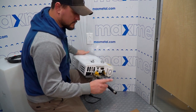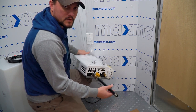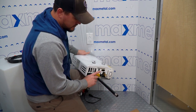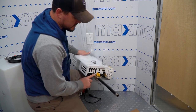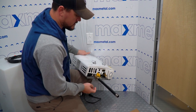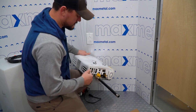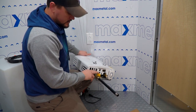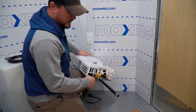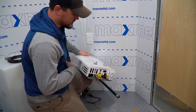What I did here was get a 12-inch black pipe, which is a gas pipe, and I've got an on-off valve. These are half-inch connections on the heater, so I've got a half-inch shut-off valve so I can shut the gas off inside the trailer, as well as obviously on the tank on the outside. I've got this hooked up; I still need to tape it, so I've just got everything loosely fitted for now until I get it installed.